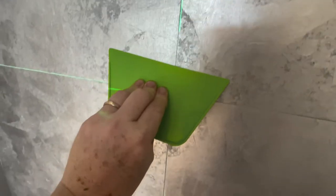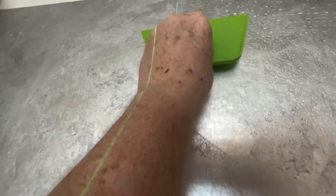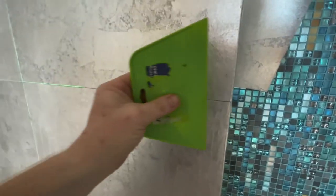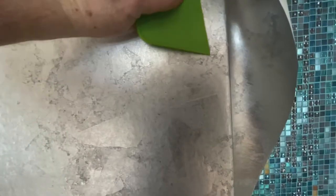Gently pushing those seams just together. I'm compressing them. I'm embedding the seam. What does that mean, I'm embedding the seam? I am pushing the seam into place where it will be for the rest of its life. It's one thing to just put the wallpaper on the wall, but when you embed the seam, you're pushing it into place for permanent installation. Folks, this stuff is sensitive. Now I have to say, it doesn't scratch.